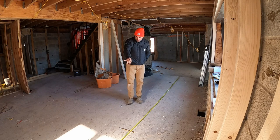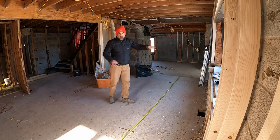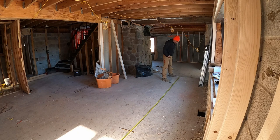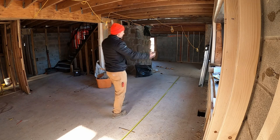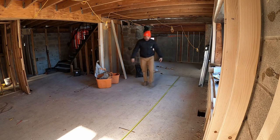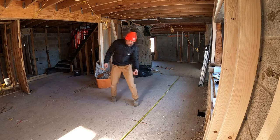I'm going to have stools underneath the overhang. I want people to move about the kitchen — I know I'm going to have a lot of people over. You want to maximize your dining room table space, but if that table's too big, can people function in the space well? Three feet certainly feels too slim in here, being that number one, I don't want anybody getting hurt, and number two, this is the main and only thoroughfare that goes into the living room area. So now I'm leaving four feet of space on the stair side, four feet of space on the kitchen side, and now I'm looking at a seven-foot table.